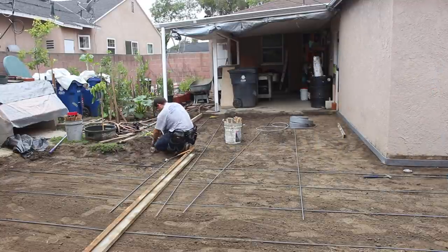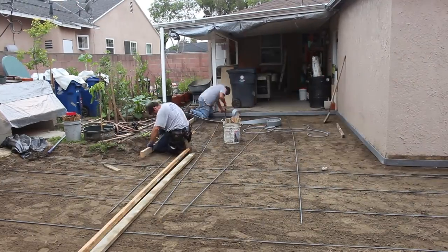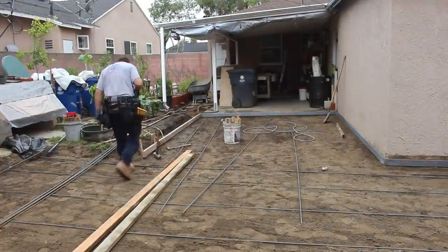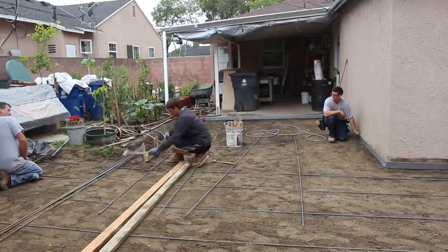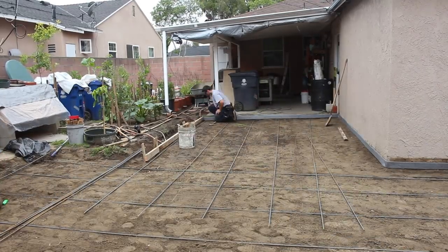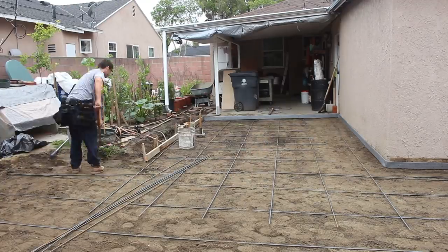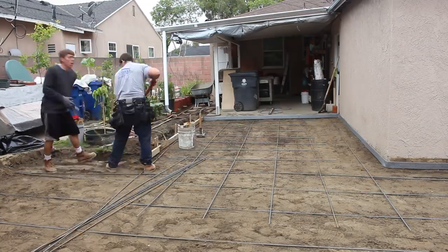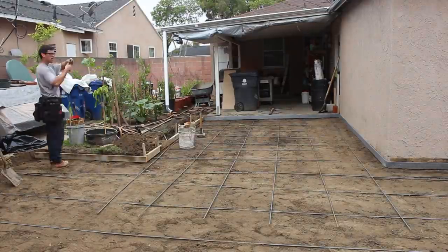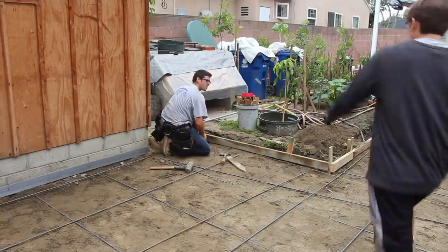You can see the slope on that patio created a low point. Before we dug this dirt out, the owner had actually cut a trench in the dirt just to get the water to run out around the side of the house. What I've done is simulated that same concept in the concrete — but more subtle, swaling it. That low point to the back corner of the house is your drainage point. You always have to work with what's there without creating excess work.